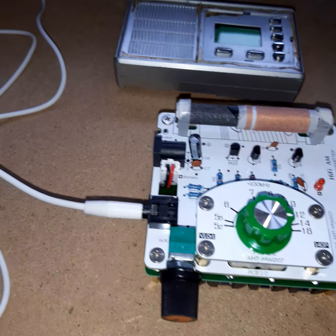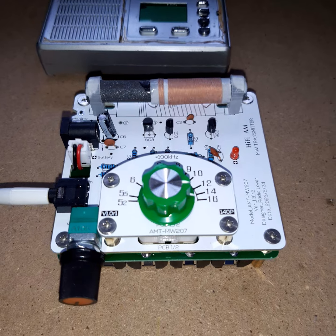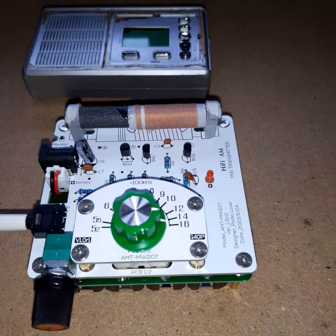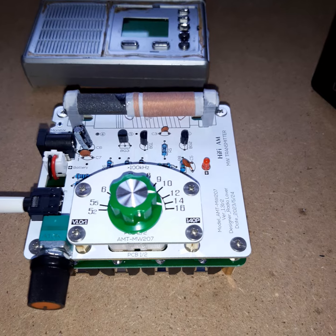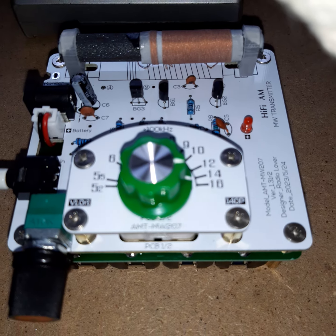So this was my review of the — let's see in the manual — AMT-MW207. AMT-MW207 radio transmitter slash modulator. About the range: the range you can get with it is about 50 centimeters from the transmitter to a normal radio. There you have a very clear, non-static signal. But after 50 centimeters, the signal slowly starts to fade out and have static. This is okay because for most use cases the range of this transmitter is fine. So, dear Radio Lover, not the best job, but overall a good job — especially the PCB layout. Thank you for watching. Best greetings from Stefan.